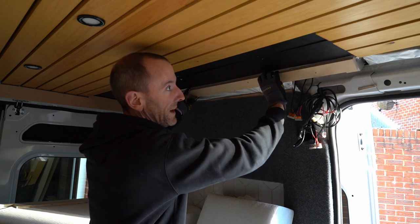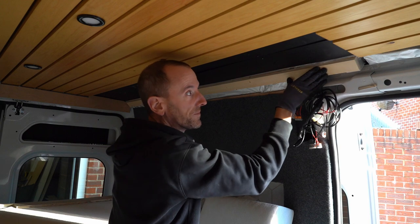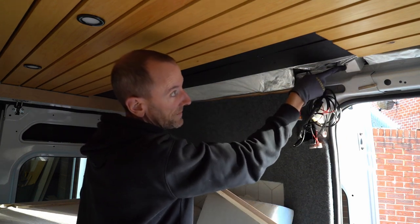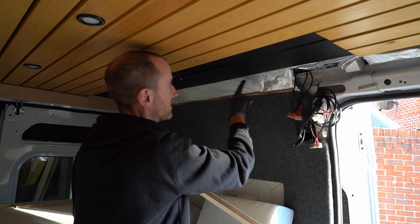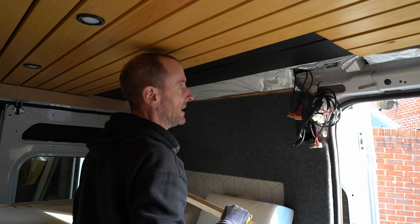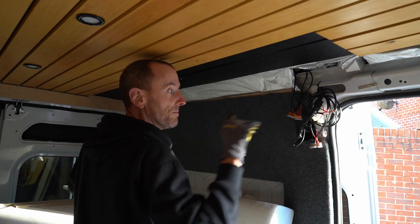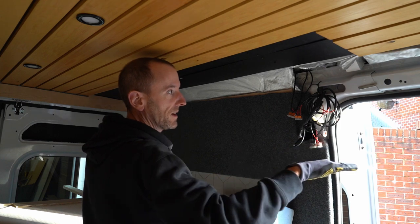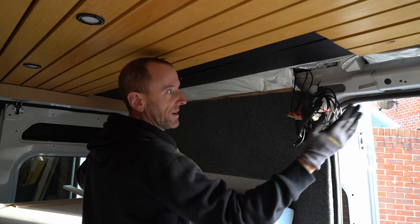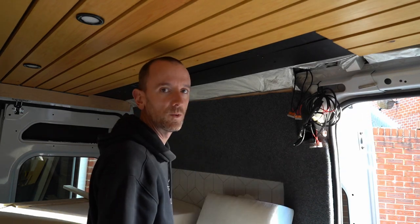I've already cut the first batten, which will fix up here to give it the support, and to help that I have got a little extra block this end to screw into, as well as the main one here and on there, so it bridges that gap. So what I'm going to do, the same as the last one really, build the front frame, make sure we've got the depth right, cut out the ply for the base, and then build the ends, and then we need to just consider, like I say, what's going to go on behind here to make that all neat and tidy.